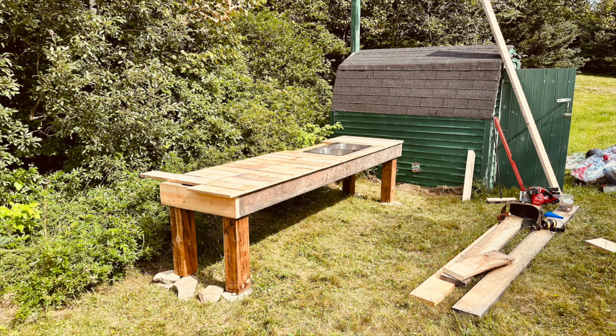So the only problem was that I couldn't get the pump primed last year. I was filling it up with water from the top, and I could not get the air out. There was air all the way through that 1-inch PEX because it wasn't perfectly flat, and there's nothing I could do about that really. So I did some research on the internet and got some great advice from somebody that installs pumps like this.